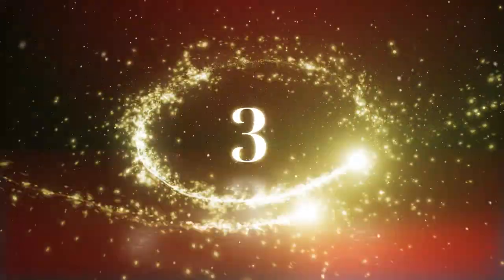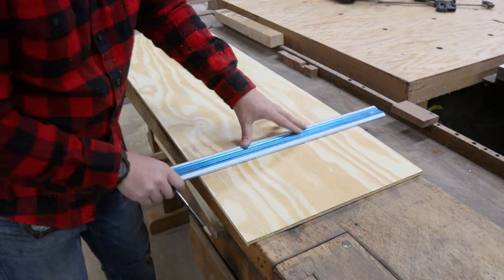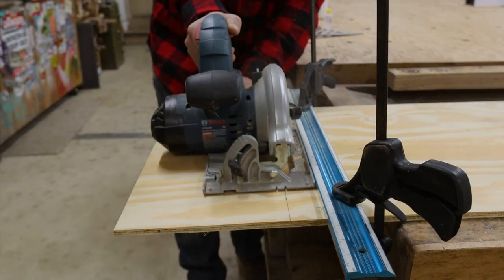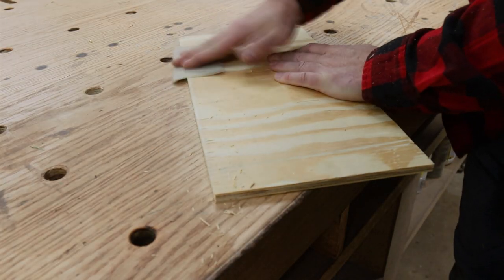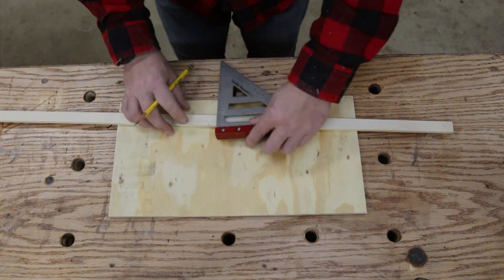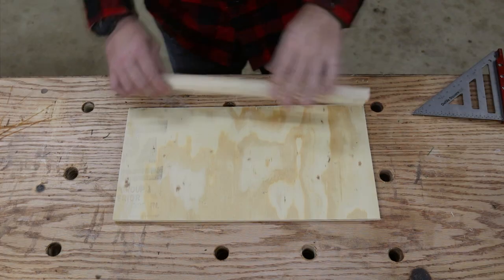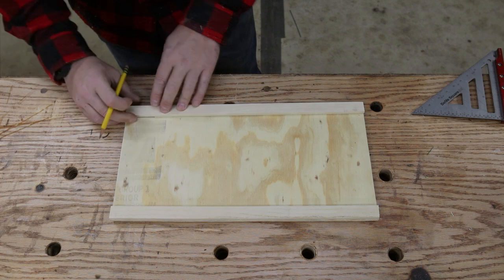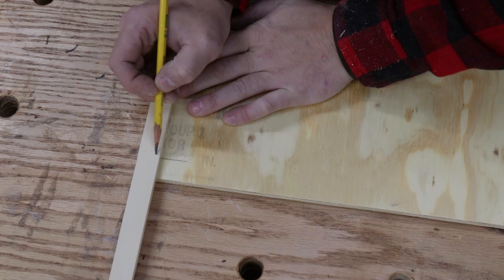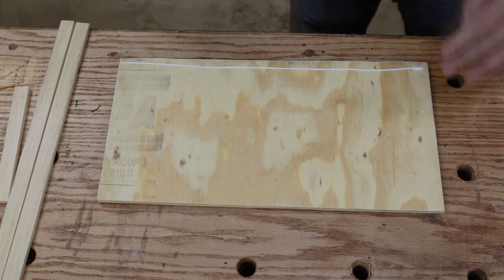Number three. I picked up a 16-inch by 48-inch sheet of 3/8 plywood, and we're going to be using it for three projects. The first one is a joy sign. I cut off a piece that is 8 inches wide and gave it a good sanding, since plywood has a tendency to chip out. For the border, I picked up a piece of 3-quarter inch by half-inch pine and laid it on top of the plywood to get an accurate measurement. Then with the jigsaw I cut the first piece and took measurements off that to make sure the border is perfect all the way around.